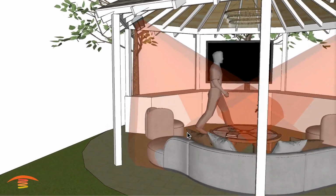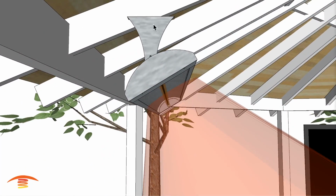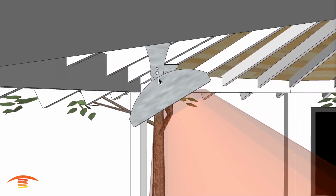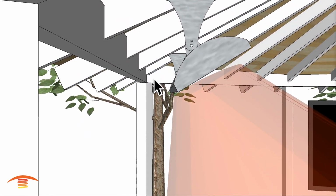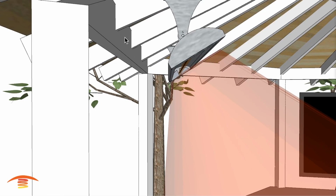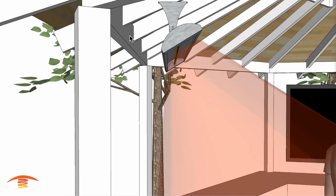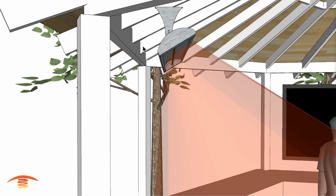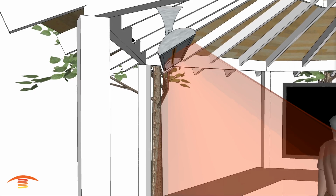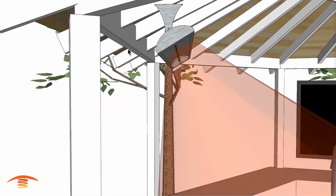Now, just keep in mind, you need to mount the units on the ceiling and maintain the 6 inches of clearance, and then 6 inches of clearance back here. If you try to put it over here, which you don't have enough room, once you mount it on a vertical surface, the manufacturer states that you need to maintain 12 inches of clearance above. So that's why I'm not recommending this model as much, but definitely not on this beam going across here.